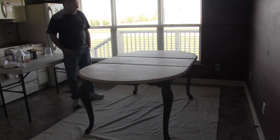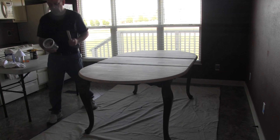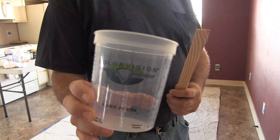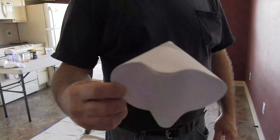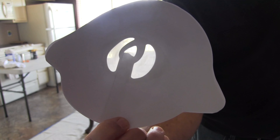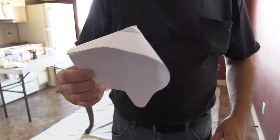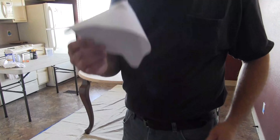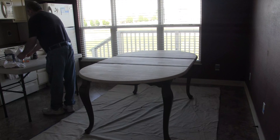In about the next 10 minutes I'm going to vacuum the table off one more time, and then mix the polyurethane. I'm going to pour it into a mixing cup here from my favorite auto body supply store, Color Vision in Springfield, Missouri. I'm going to pour it through one of these strainers — you can see it has a very fine mesh screen in it — to make sure we don't get any debris or particles into the mixing cup.